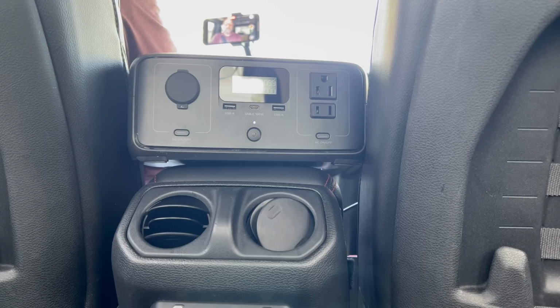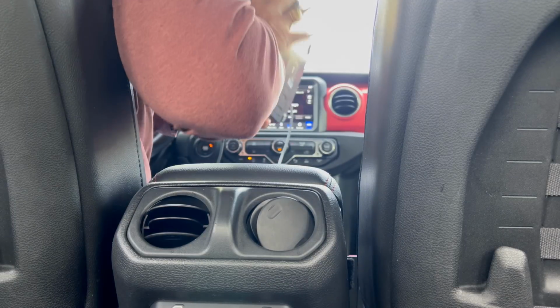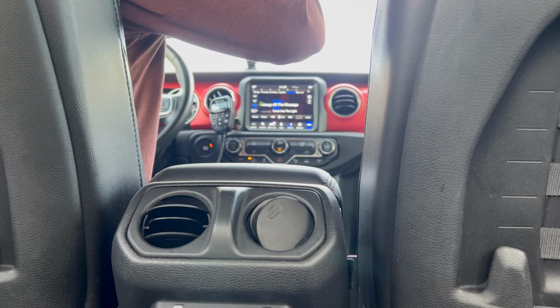And I actually did that test. I see what the stats say, what the booklet says, but I want to run my own test. So we're going to run a test. How long will it take for the EcoFlow River 3 to charge in the vehicle? It comes with a 12 volt cigarette lighter type socket, and then an XT60 that will plug directly into the battery. I don't anticipate it being as fast as plugging it into the wall, because we're not generating that much power in a vehicle. It says that it's going to take about 2 hours to charge the way it sets now.